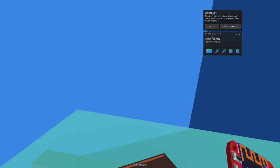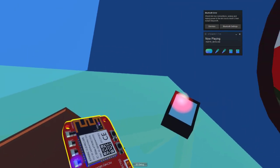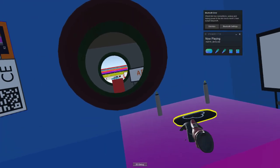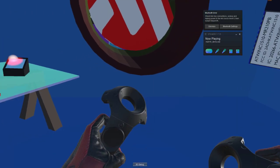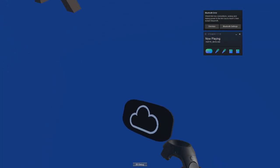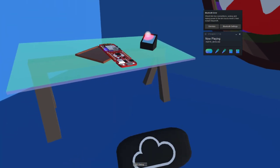So if we've successfully done that, then that blue LED is going to go static, and we're going to see that green LED start to pulse. It's indicating that it's now trying to establish a TCP socket connection. So to establish that TCP socket connection, we're going to need to load our broker credentials inside of the device. That's going to be our cloud broker credentials.